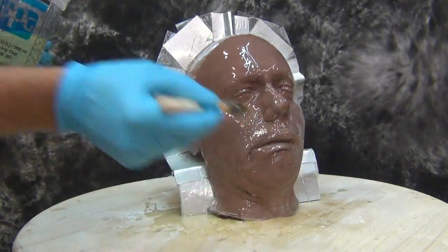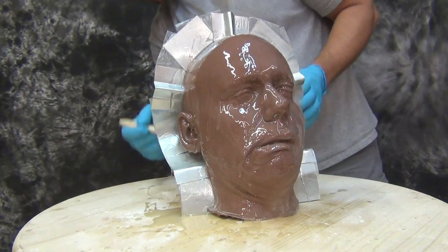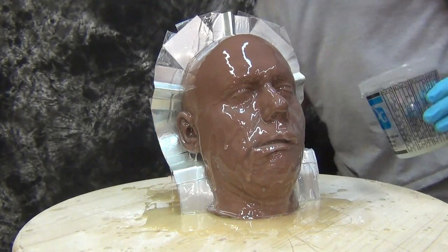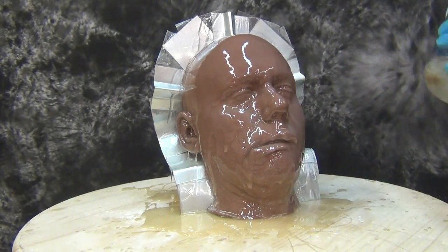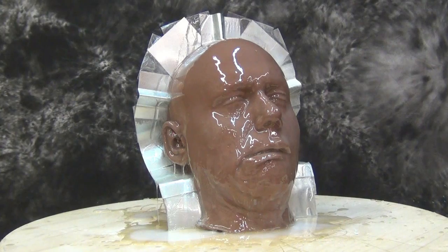Work fast and deliberately to get the entire surface coated. If you need to, work in small batches — one for the front and one for the back. EasyFlow 120 is a fast setting resin; it kicks off in about two and a half minutes. If you want a slower setting resin, I would recommend the 1512X or the 1511 — those are 5-minute and 10-minute working time resin systems. For this project we want to move quickly, and as you can see that layer is already kicking over, so we're ready to mix up our second batch.